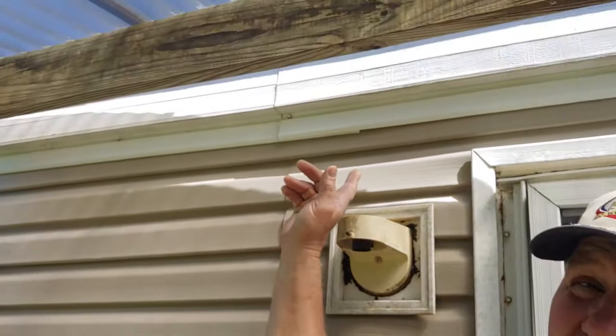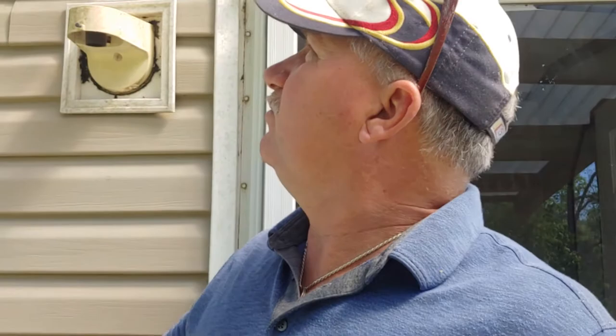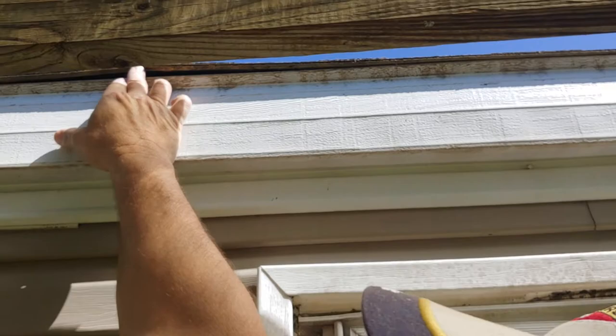Build the deck right so it will support its own weight, and connect it to the house. That way you won't have water running down inside your own porch, which you put up to keep water from getting on you. Generally what I would do is go underneath right here so that I could take flashing and go underneath there, over on top of this. First thing I want to do is fasten this to the house so we can get a good firm connection.